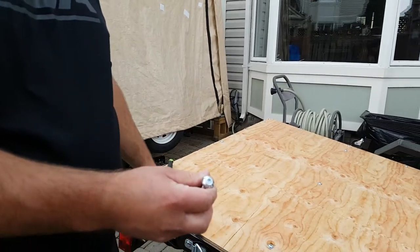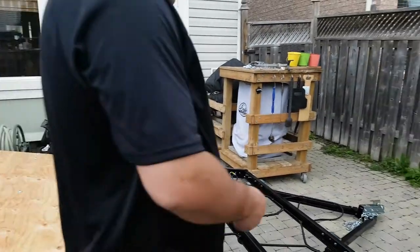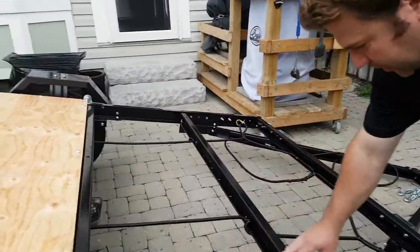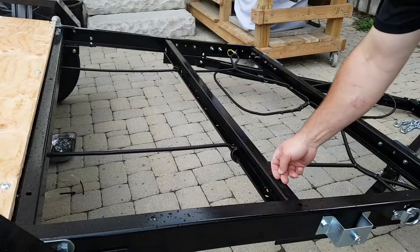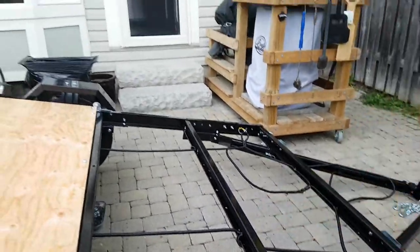You can use these to help fasten. I'll show you here just so you understand the reason for the dado. The side rail, side structure here, and our cross members — the cross members fit inside, so there's a bit of a lip there. That's why we put that relief so our plywood sits nice and flush.